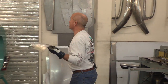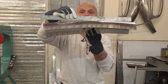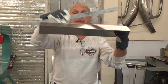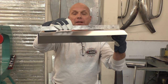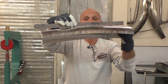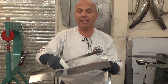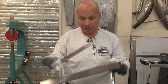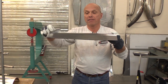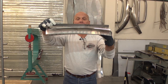Now you can see we have so much curve to this piece. Remember the other piece I made - this one is flat. The flat one can also be made with a slip roller, or as I did it, with a rubber band in the English wheel. But when I pre-stretched it, you can see how much curve we still have in it. If you want to create the same thing starting from the flat piece, you need to shrink a lot and deeper from the edge - it's not enough to just shrink the edge, you need to shrink like a pie shape: harder on the edge and less and less the further in you go. But it's an easier and smoother way to do it if you pre-stretch it in the English wheel first and then roll it with a rubber band.